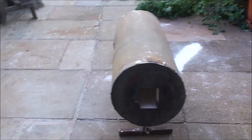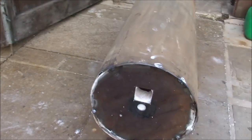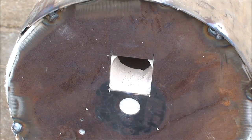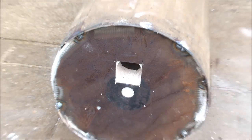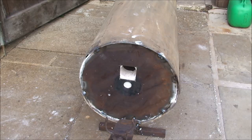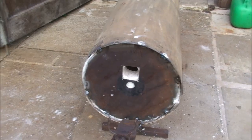I've got the tempering oven finished. There's the hole on the back where the burner goes in. I did film the kaowool lining going in but accidentally deleted the video — all it is, is two inches of kaowool on the inside of the drum. I painted a rigidizer on it to stop the kaowool falling apart and dissolving with the heat. The rigidizer was zirconium silicate and water glass painted on, then another layer of zirconium silicate and porcelain clay painted on top of that. It's baked hard — I've had a test fire and it's kind of baked on hard, though there are a few cracks inside it.